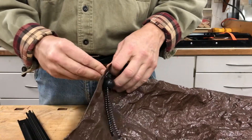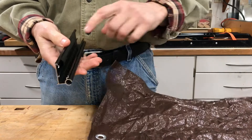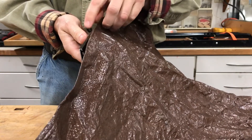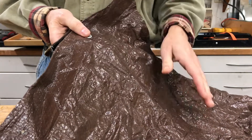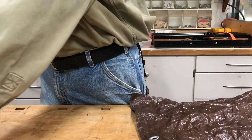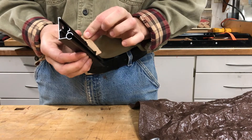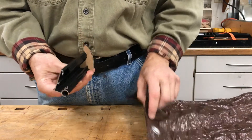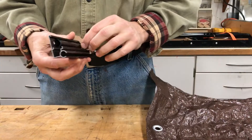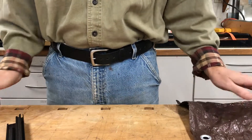The solution I'm going to propose is to make a type of hook that you can drop in at any point on the track that holds the tarp closer to the roof. Any water that gets under the tarp will end up in the channel of the gutter, and most of the water is just going to flow over the top. I have a sort of mock-up here — it's a very crude idea — but the idea is to drop a hook in, it snaps in, and the grommet on the tarp slips over that. I'll head into the computer and work up a prototype to 3D print in PLA.